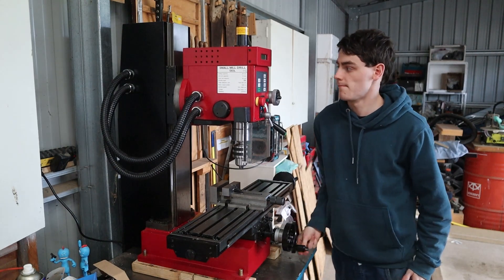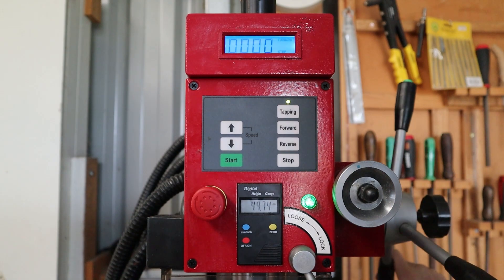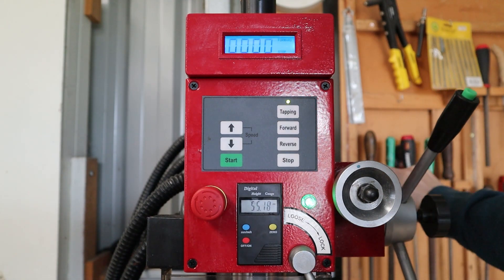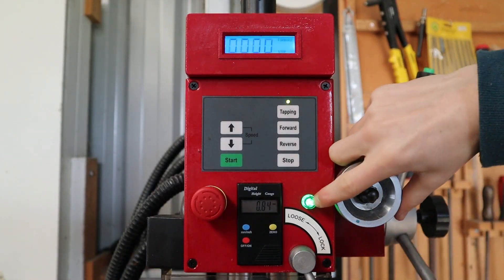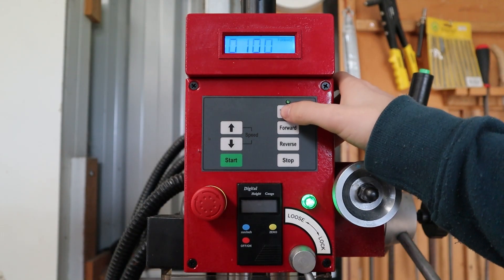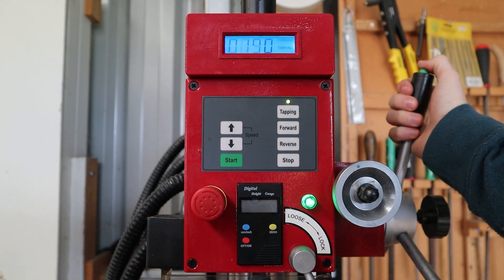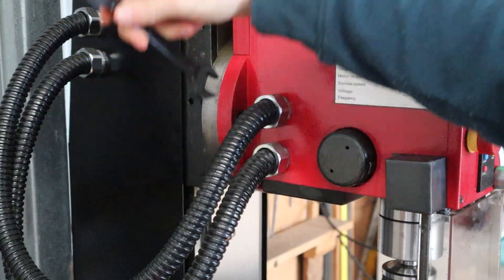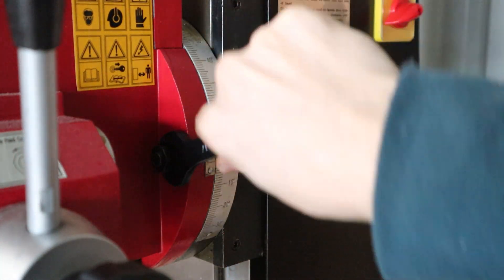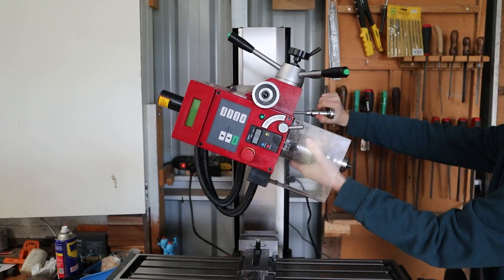The spindle takes an R8 taper with a stroke of 70mm, while the whole headstock will move about 300mm. This handle operates the stroke with a Z-axis DRO recording the measurements. If you lock this knob in and then turn this wheel you can have the fine feed function. This model includes a tapping mode feature that works from 100 to 500 rpm. The green button on the handle switches the rotation of the spindle. The whole head also has a feature where you can tilt it up to 90 degrees for horizontal milling.